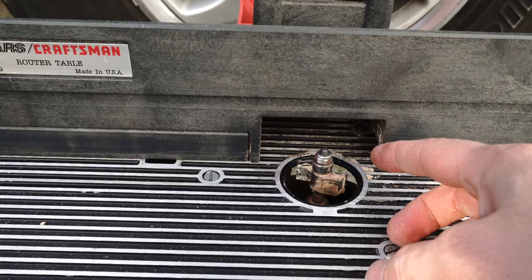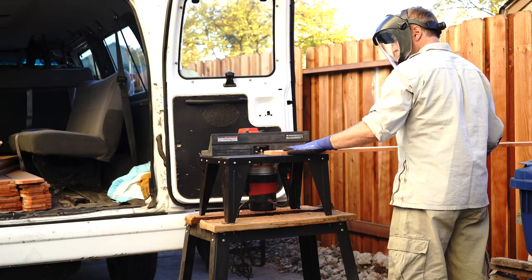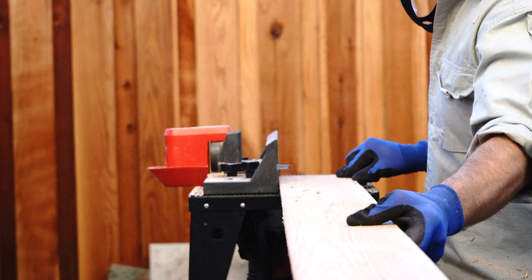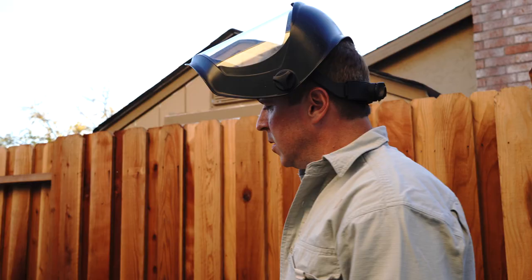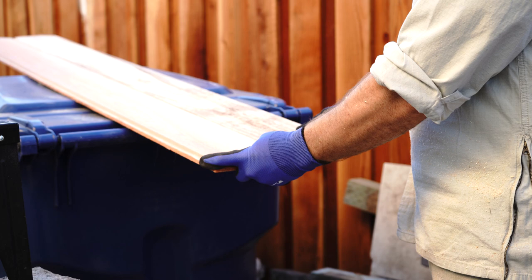As you all may know, wooden pickets become dry and shrink over time, resulting in gaping holes in the fence. So we decided to create some privacy by cutting both edges of the picket to create an overlapping joint. So I've got two of my test pieces, and this is called a shiplap, which is basically overlaps one another and creates a perfect fit.